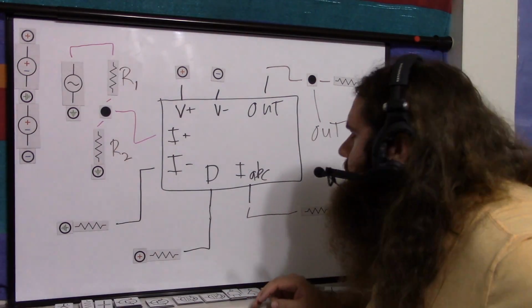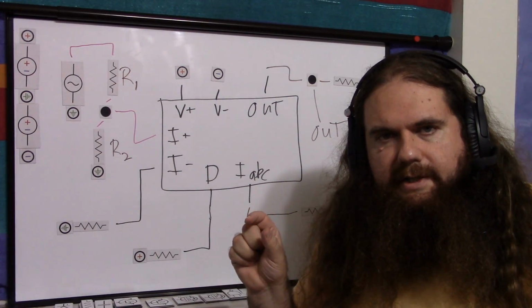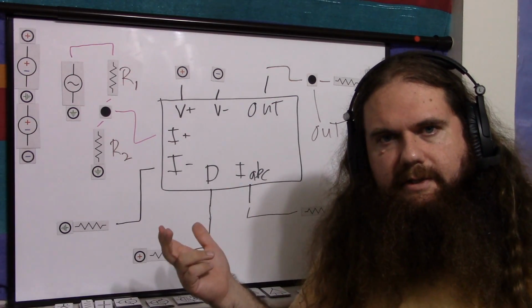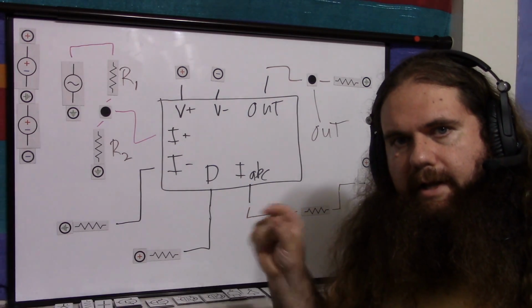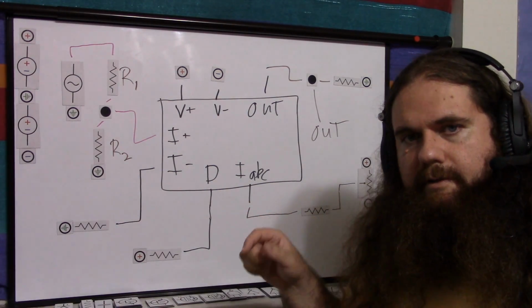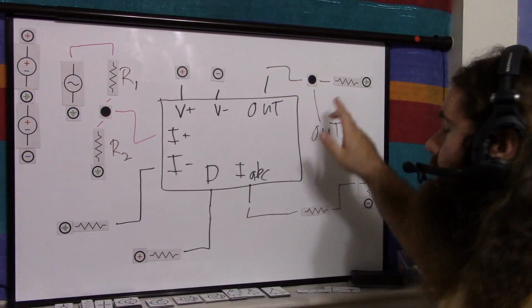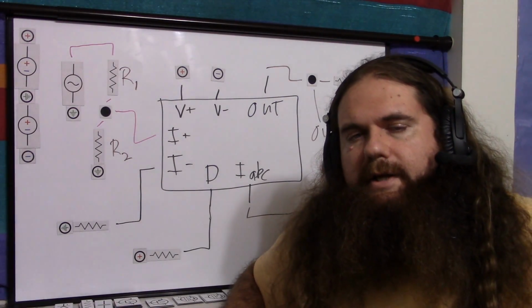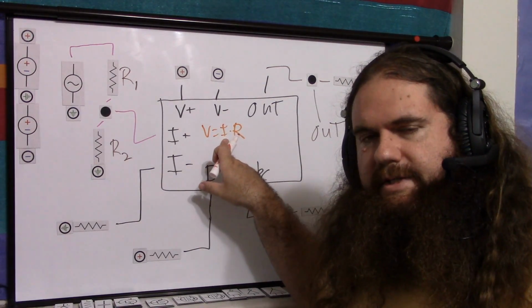And your output is a current again, and you can guesstimate the transconductance from your datasheet. Input differential voltage times transconductance equals output current, or just use, once again, a trim pot variable resistor at max volume to figure out the maximum voltage swing you want. More resistance is more voltage because V equals I times R. V equals I times R, and the current is the same.